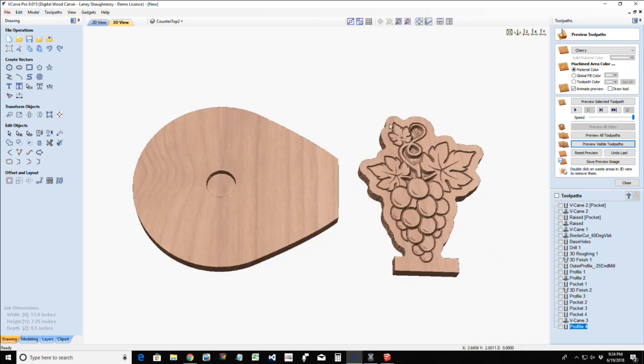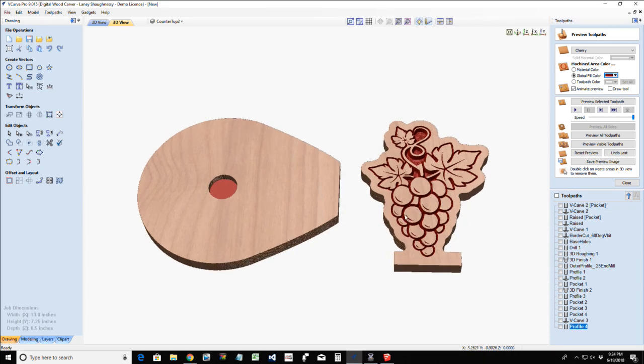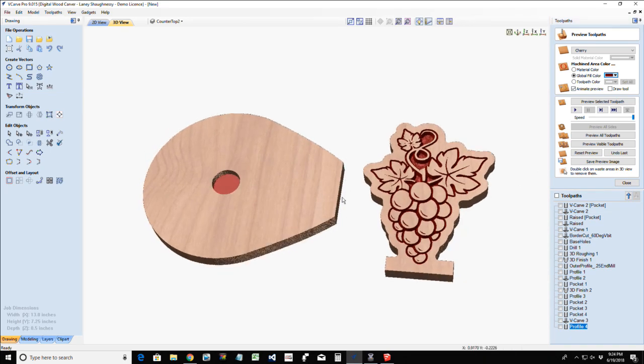Okay, and this part here would be attached to the front of that. Give it some nice color or whatever, autumn, spring, whatever matches their kitchen. This bottom part here will be attached to the front of this. No hardware. You don't want any screws or anything showing. If you want to be fancy, you can do some joinery, half lap it, whatever the case may be. But a simple edge glue will hold super strong. And if you get your seams right, they'll disappear, you know.